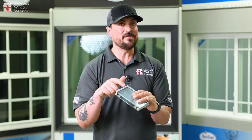They may not give you the green light on the claim for your seal failure, which in normal circumstances they would say, yeah, no problem, we're going to replace that dual-pane glass unit because that shouldn't happen. Whether or not you have Low-E is besides the point — you're still creating that issue, though it's not going to be as severe as if you have a Low-E coating, because that's what creates the heat pocket. Hopefully this helps you understand the difference between a single piece of glass with tint and a dual-pane glass unit with tint.